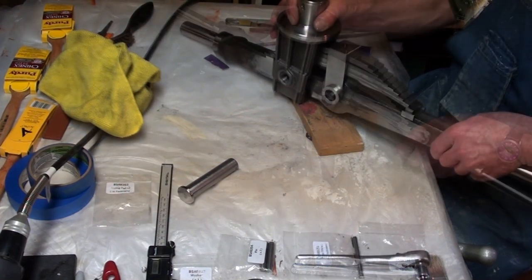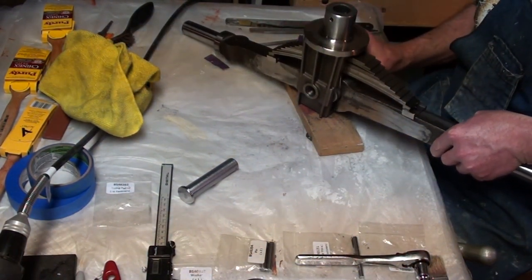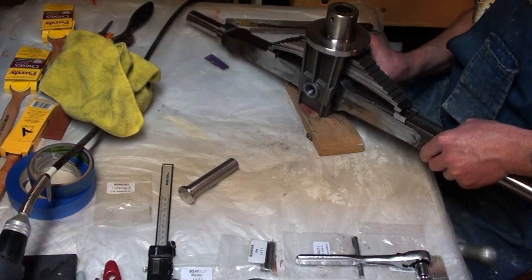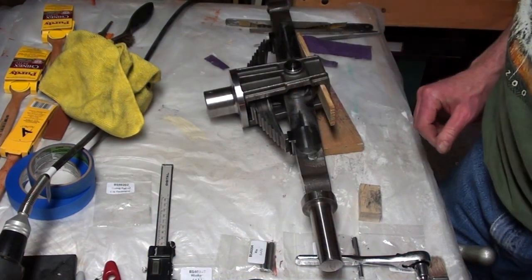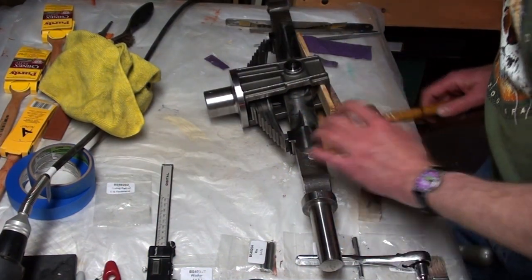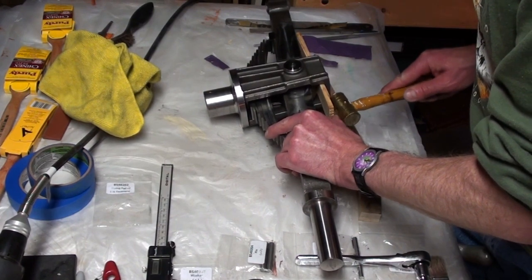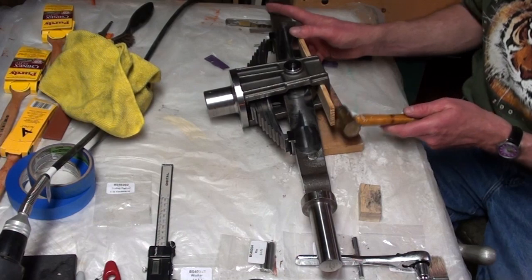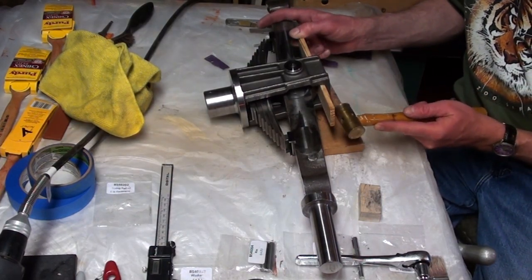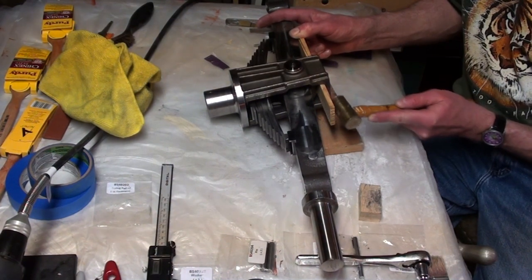To assemble the spring assembly and axle together, it is necessary to slightly compress the spring. For test fitting, this was done by aligning the pivot and one side of the spring hanger holes and using the pivot pin to secure them in place. Two opposing tapered wooden construction shims were forced between the axle bottom and the bottom inner surface of the pivot casting. We realized this would never work once the parts were painted.